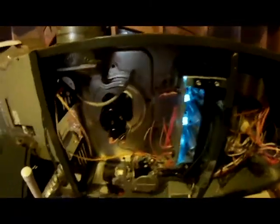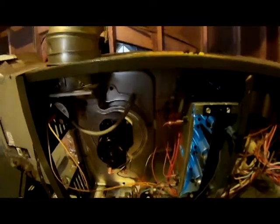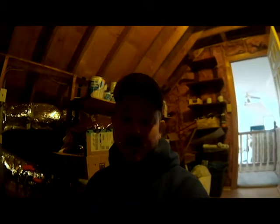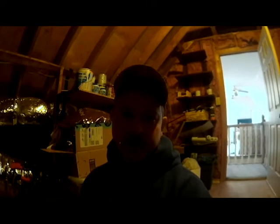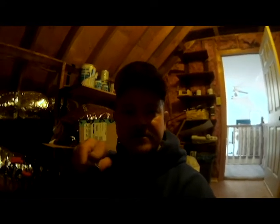We'll put this back on, turn power back on to our furnace, and see if everything starts up. The furnace started up. So the whole problem was a clogged inducer orifice. Pretty easy service call here. I hope you guys learned something, and if you did, please hit that like and subscribe. Anytime you have a pressure switch failure, the first thing you always want to check is the inducer orifice to make sure it's not stopped up. See you on the next video.